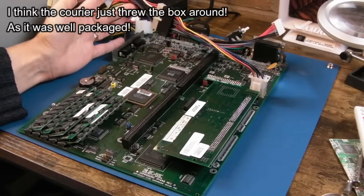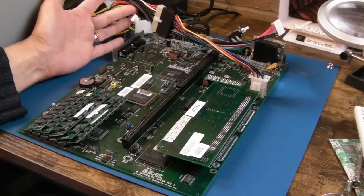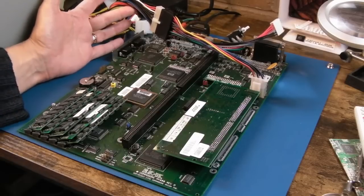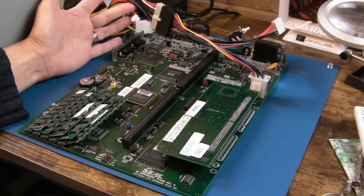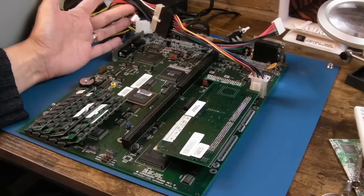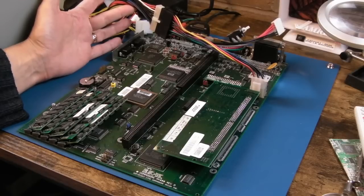But Chris, Cathers, did a good job of fitting a replacement port there and fixing it with a couple of wires. It just needs a little bit of a reflow, because I noticed the solder points look like they've been done with lead-free solder. They go really dull, not very shiny. So I think we might just remove the solder there and add a bit of fresh solder, maybe change the gauge of the wires. He did express concern himself about the thickness of the wire he used. But he's done a good job, is the point.